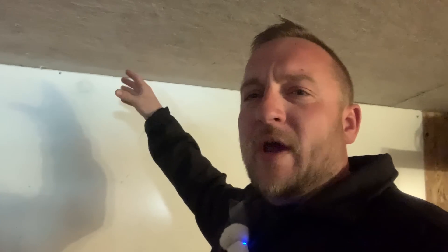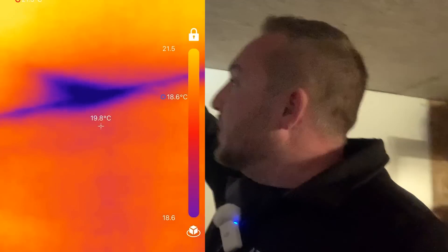My shop doesn't have an eave overhang going out, so with blown insulation I was only able to put about six inches there. The rest of the attic has 32 inches or R80 blown in. But on any building where the eave goes one way and the trusses go the other, out here in the top corner is the coldest spot, and that clearly shows up.